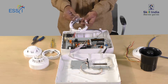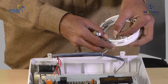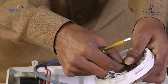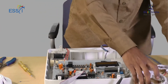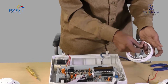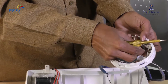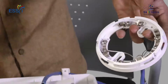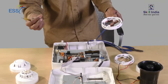The other end of the cable is connected to the base. Positive wire is connected in L1 and negative is in Earth. All the smoke detectors are connected in series. For the second smoke detector, the inputs are from the output of the first detector — taken from L1 out for positive and Earth for negative. A resistor is connected to the last sensor or detector in series.